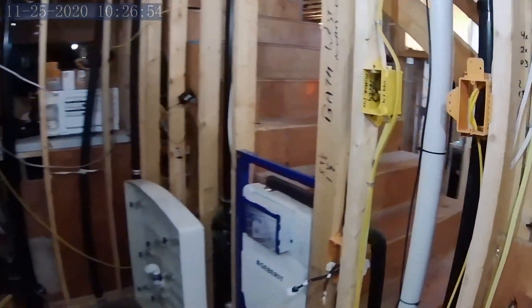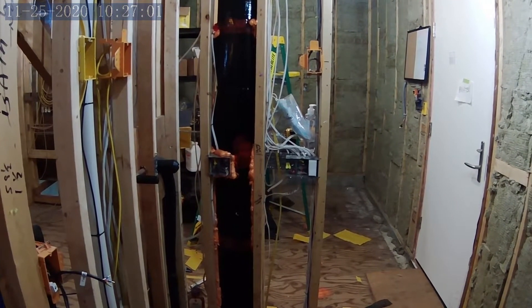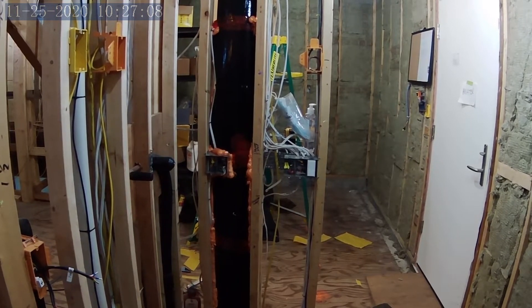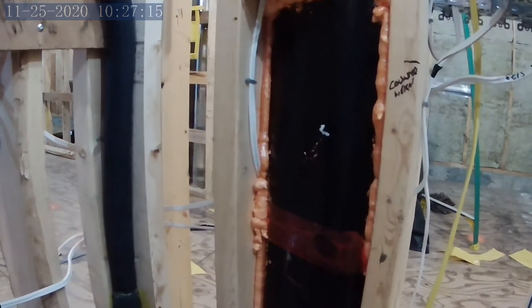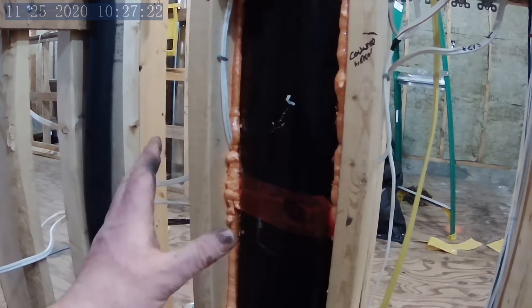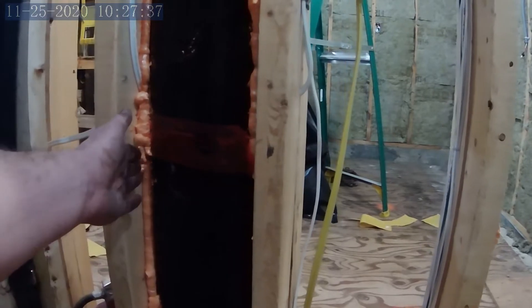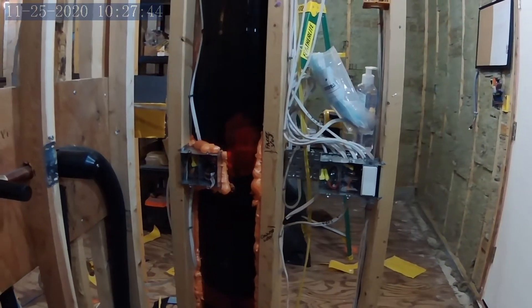You can't avoid all plumbing. I used the product, and I used spray foam where it was easier to seal — like around wires. I also used spray foam to hold it in place, because at this location the pipe was so close to the side that there was no way I was going to get the product all the way around. I had two stacks — one was a vent, one was the drain. So I basically did a tent that I sealed to the two-by-fours on each side. It's attached to the pipe on the face, but at the sides it doesn't go all the way around. Then I did an equal piece on the other side. But it has made a huge difference.